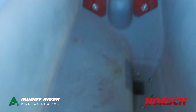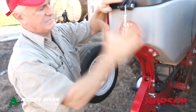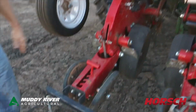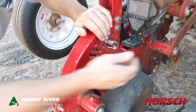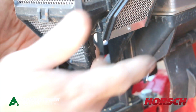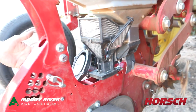It's a 70-litre hopper, and so when you close it down, it just shuts up. Nice and easy. You can fold up, nothing will leak, can't come out, and it's simple as. The other good thing when we're doing the trials today, you'll notice here there's a trap door. These doors in here, when the disc's in, you can actually see seed being stuck or sucked by the vacuum onto your disc. So it's a peace of mind thing.